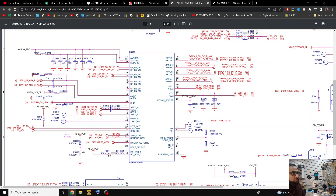There is no ground to this IC except for one ground, which is on pin number 49. This IC has 12 pins on one side, so multiplying by four gives 48 pins — 48 pins are not connected to ground. But under the IC, the pad is used as pin number 49, and that pin number 49 is ground only.